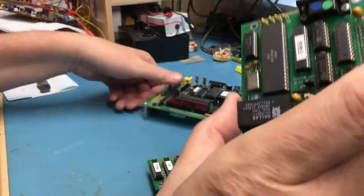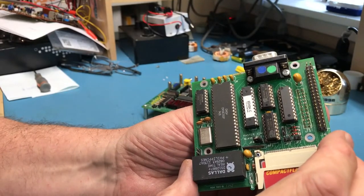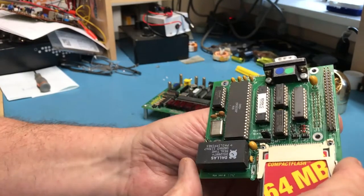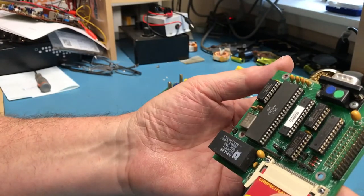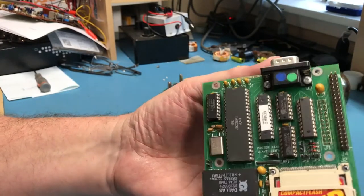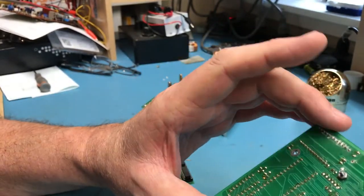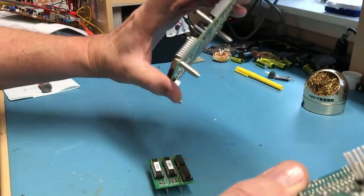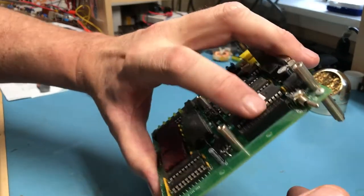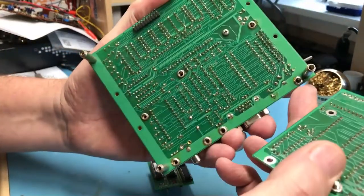There's another board here that I put together that has not been tested, and this is the, what does he call it, the disk IO. There's a name for this. Anyhow, it emulates mass storage. I believe it emulates like a floppy. Same construction technique: dip headers, wire wrap sockets along the edge here, plugs down in, screws into these standoffs that are soldered to the board.